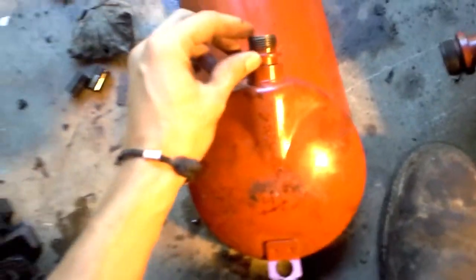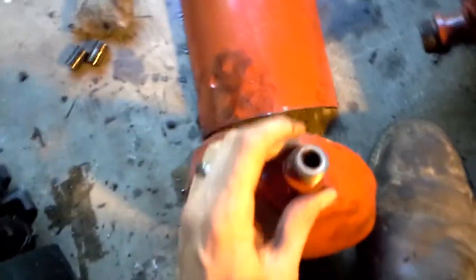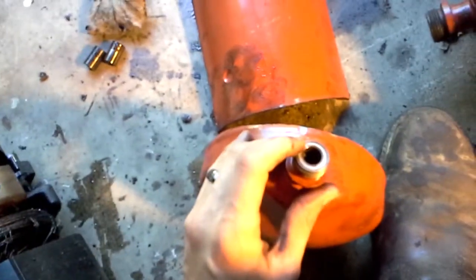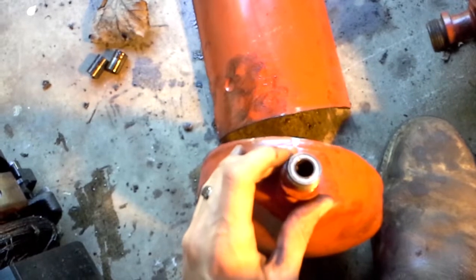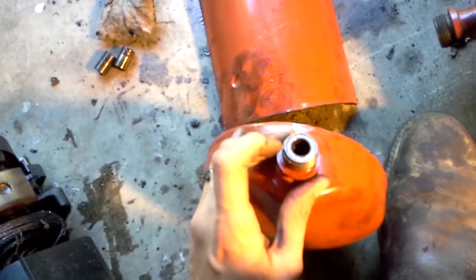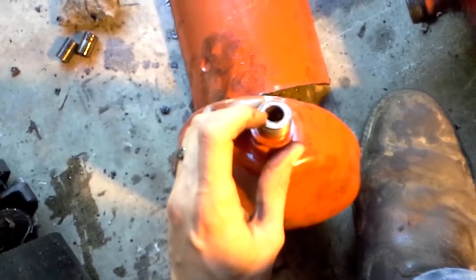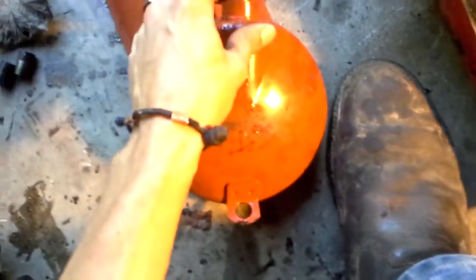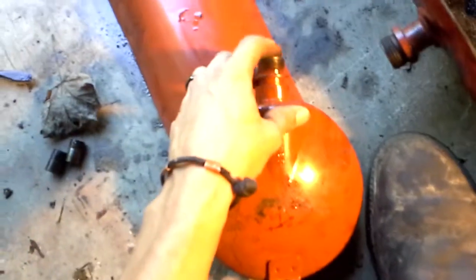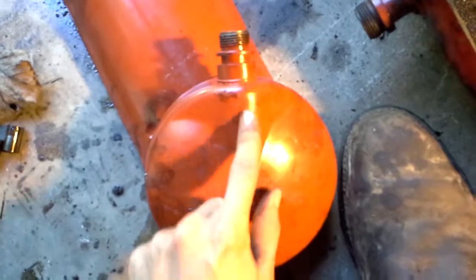On the rotor locks, the reason they call it a rotor lock is there's a nut that actually threads onto this — it's not sweat — and there's a Teflon gasket. Always make sure you put the Teflon gaskets in. I've gone out to a couple of leak checks where that was the problem; guys would crank them on so tight they'd twist the lines because it wasn't sealing. You need the Teflon — it is a compression seal, but the Teflon needs to be in there, no different than doing a piston on an evap coil.